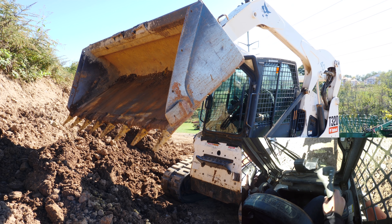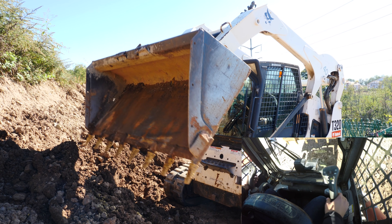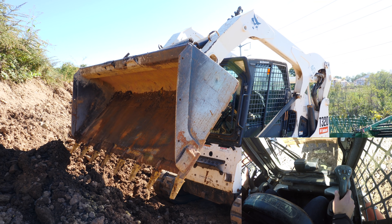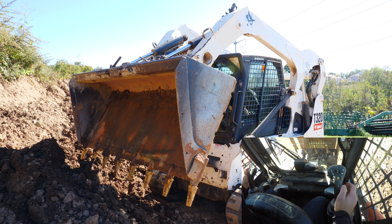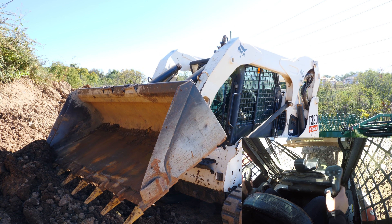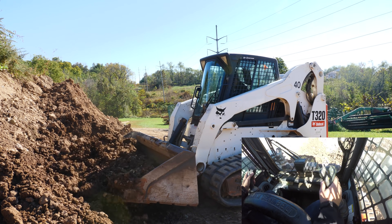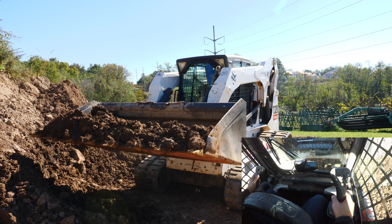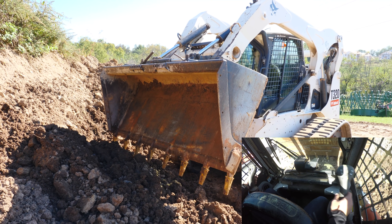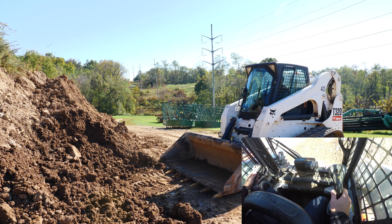So now my dirt's not stuck in here, but there's a rate where the stick is just not responding to my motion. I go really quick and I'm getting basically no movement at all. As I slow down, I'll start to get a little bit more shake, but I'm just not getting that much shake out of it. A lot of the motion you're probably seeing from the bucket is actually slop in the quick coupler between the coupler and the bucket. I have a hard time getting quick motions out of the machine when these electronics are always interpreting what they think I want to be doing — even at high RPMs with the thing wound up all the way.